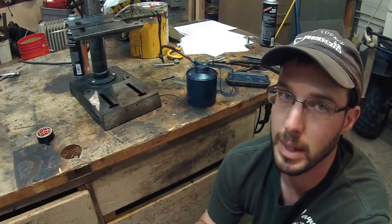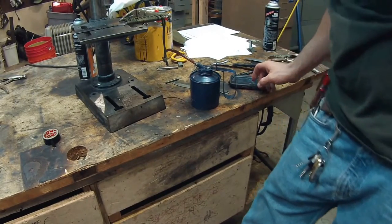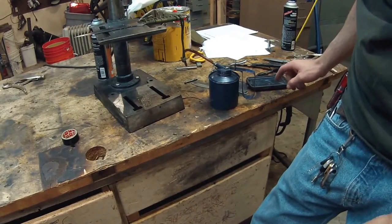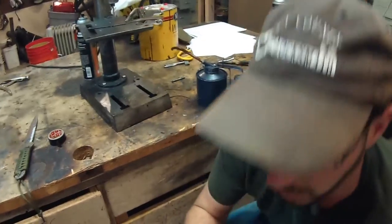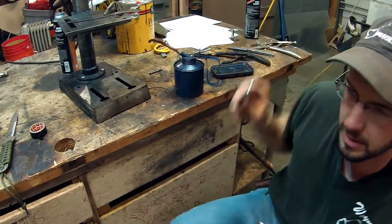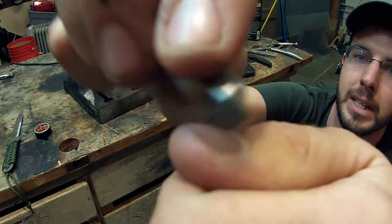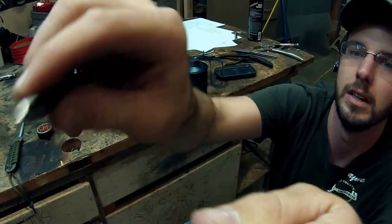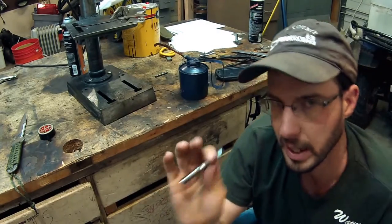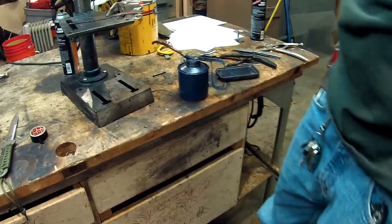This is a great drill bit for knife making after the steel's already been hardened. For more information, go to TricountyLocksmithService.com or drillbitwarehouse.com. These are called carbide bits. This is the larger size to show you the angle — they have this really sharp edge, not like a masonry bit, more like a regular drill bit, and that sharp edge allows you to precision-cut and machine holes into any kind of hardness of steel.